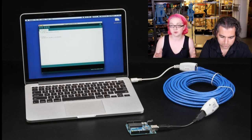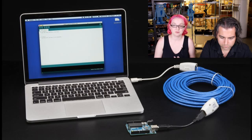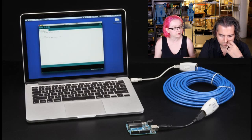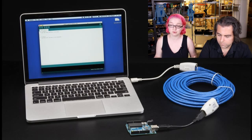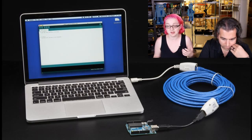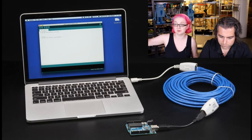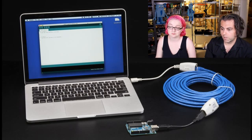We tried it — it works. We tried it with an Uno and a Metro. We don't guarantee it works with everything. It definitely doesn't work with USB 3.0, and it will not work with video stuff because that's usually high speed. It uses only low and full speed — USB 1.0 and 2.0. So basically Arduino programming, microcontroller programming, basic stuff — it works great. Taking photos might work, but only if the camera isn't sending full-stream video. This set works really, really well and kind of solves the problem of wanting an Arduino 100 feet away without involving an XBee or RFM module. You just run Ethernet cable — thin Ethernet cables work great too.